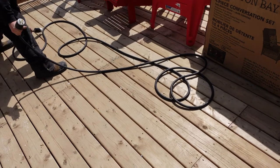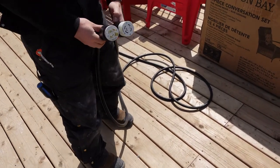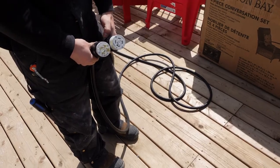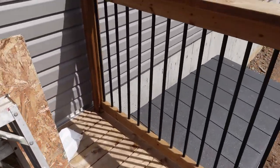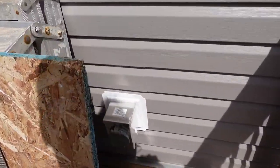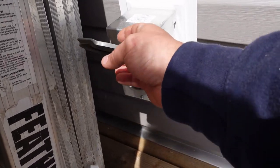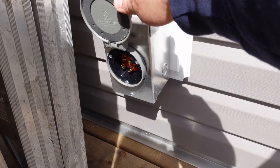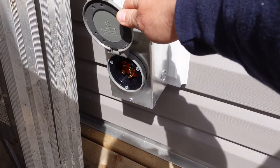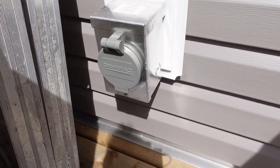You can see the cord we've geared up — it's a 30 amp cord. We've shown this in other videos. It has a male and a female end. Over here on the side of the house we have a generator inlet box which is what it plugs into — this is 30 amps and it's made by Generac. I can put a link in the description below for where to get these. This is where it plugs into the house, and this goes into the generator side of the transfer switch.